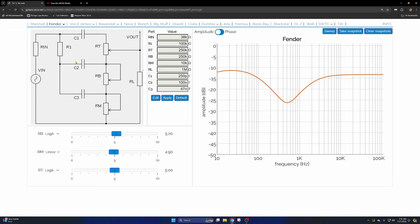There's your treble cap, bass cap, and mid cap, and then treble, middle, bass controls, and slope resistor. Now the slope resistor — a lot of people don't know what it does, but it basically sets the amount of signal going between the treble control and the mid and bass control. The higher this is in value, the more high frequencies you will have, because it's allowing more to go to the treble control versus the mid and bass control.